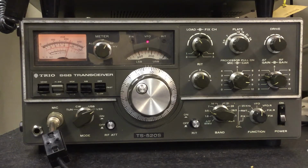It doesn't tell you to do this in any of the antenna books, but if it works, I'll go with it. The original G5RV had a 300 ohm slotted feeder in its design, but on this one I changed it a little while back and put in a 450 ohm slotted feeder, and I cut it long. I made a mistake when I cut it because I had an idea to bring the feeder straight to the shack, which was the small bedroom on the front of the house. But best laid plans, as they say, I cut it 2 foot too short, so I just modified it, put a piece of coax on and ran the coax into the shack. And hey-ho, it works. So if it ain't broke, don't fix it.